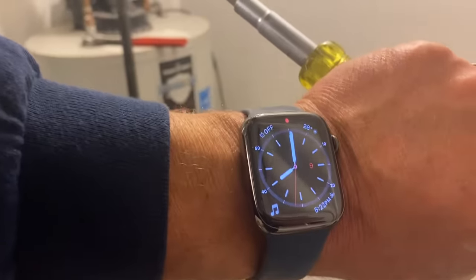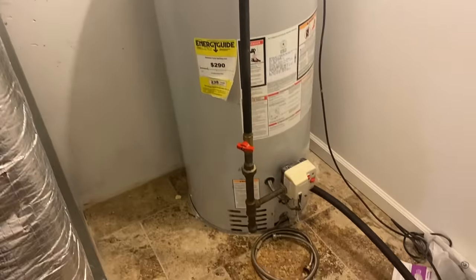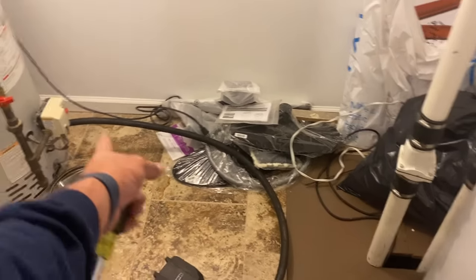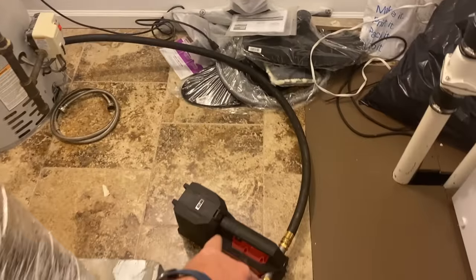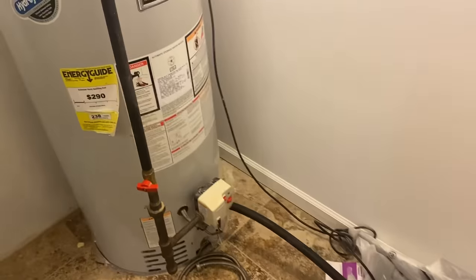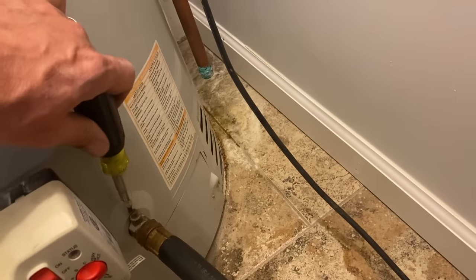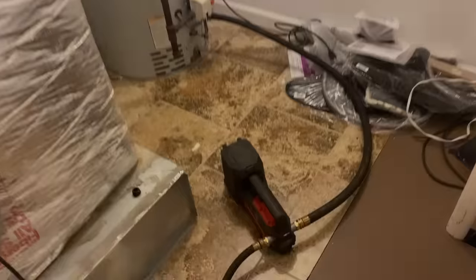Eight o'clock on the dot: the water to the house is off, the gas to the water heater is off. I have a thick laundry-mat wash machine hose — high flow — coming from the valve at the bottom of the water heater, going to my Milwaukee M18 transfer pump, and then I have a garden hose going into a shower. We're going to open up the drain and turn on the pump. The pump is on — we're draining down the water heater.